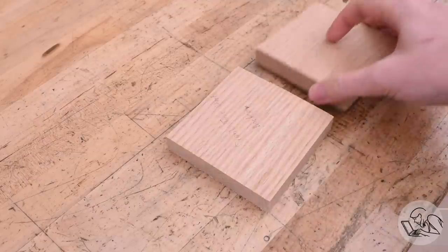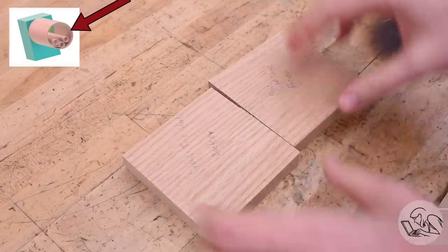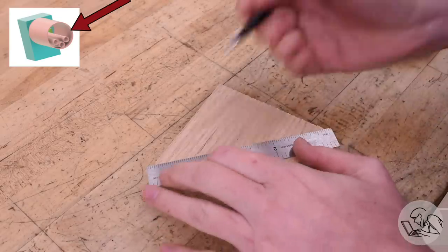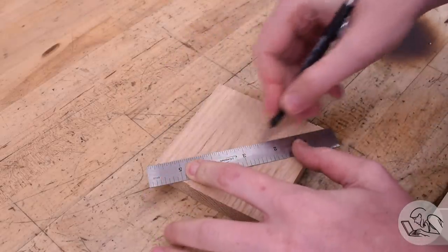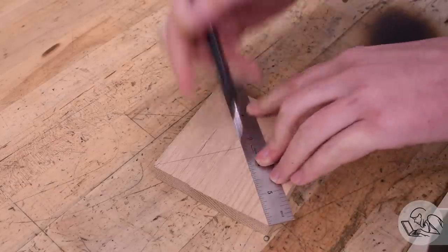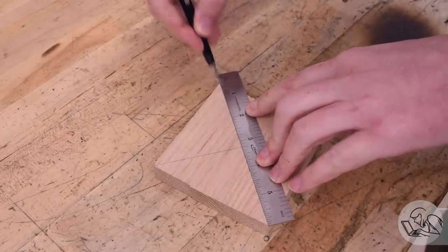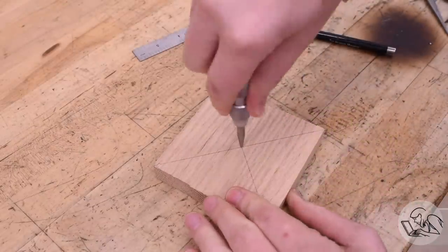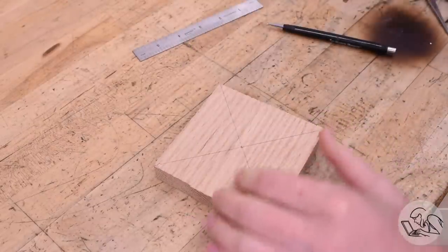I'm going to start with the front tube sheet, which sits here at the front and seals off the end of the barrel and exposes the tubes into the smoke box. This is a simple disc shape with a flange around the edge. All of these parts are made with a hardwood former. I'm using oak here. And you start by machining the former into the exact shape that you want the sheet metal to take, and then hammer it into shape.